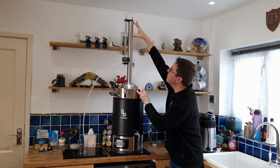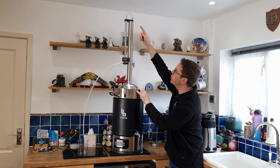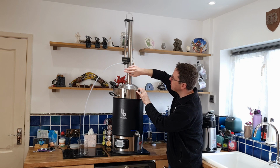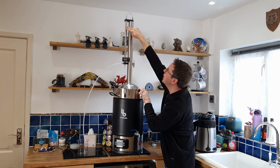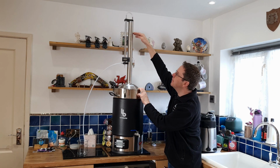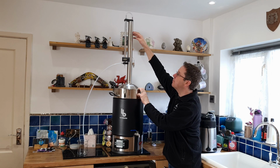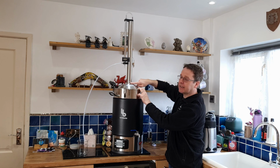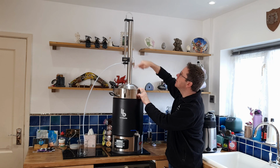Four 13 centimeters up here is a copper tube, a spiral tube that goes up, stops around about here, and it just goes straight down out to there. So what the cooling water does, it goes up through here, around, so now it's spiraling down. So as the vapor's coming up, it's hitting cold tubes, the vapor condensing again and falling back down again. And again, going through all the packing, therefore getting cleaner.